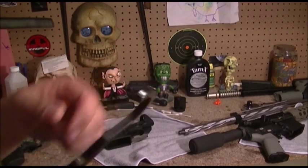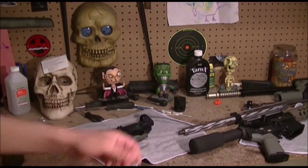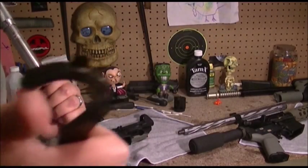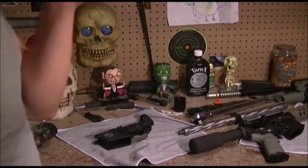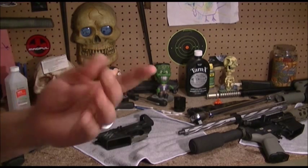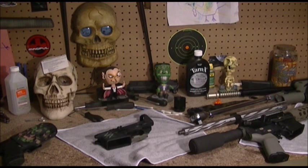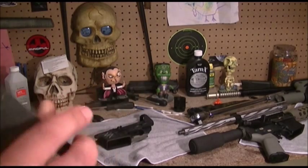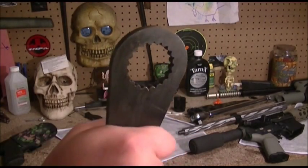Funny thing — I was putting the buffer tube on, put the torque on at 40 pounds, and boom, cracked it — little teeth broke. So now I don't have it; it's tight but I have to buy another wrench. You guys know what kind to buy for the buffer tube or the castle nut, let me know. This one is garbage. It'll still work as a handguard wrench, and I still have this as well, but for a castle nut it's not working.